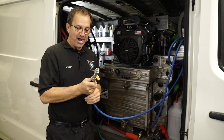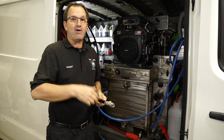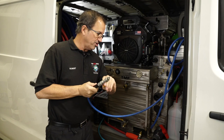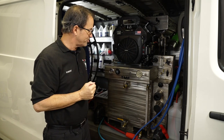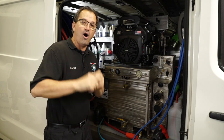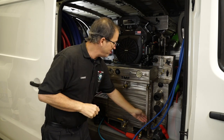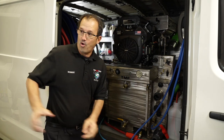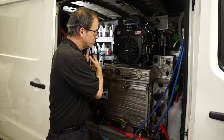Moving over here, you have a courtesy hose. Remember, the water is very hot coming out of here, so be careful when using it. It's probably better to use hot tap water when mixing up your products and just use the courtesy hose to cool the machine off. Just be careful — it is hot because that hose is very close to the machine, so you'll get your hottest temperatures there. Over here you have a dump valve where you can let all the dirty water out. Always dump wastewater according to your local, state, and federal laws. Then you have your solution high-pressure outlet — you can go live or bring your solution line around and hook it up.